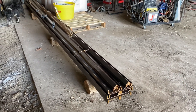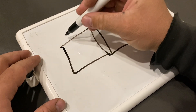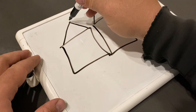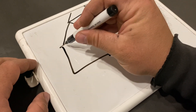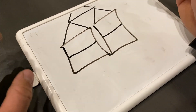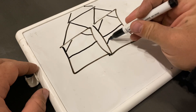Here's a rough drawing of what I'm planning on doing. I'm going to make two 10-foot levels that will hook together by a chain in the back, chain here and chain here, and a yoke up here. Then we'll use another chain up here to hook to a tractor — that's how we'll drag these. I'm going to have crossbars here, crossbar here, and crossbar in the middle that'll do the leveling. I'm thinking about doing some angle braces on each level and something like this on the back side.